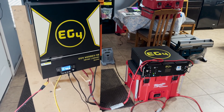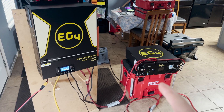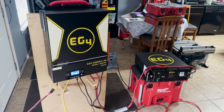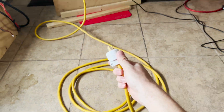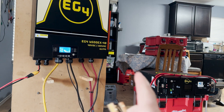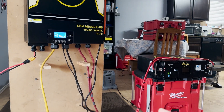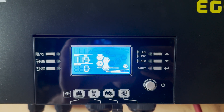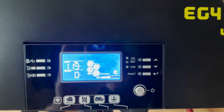Next I'm going to show you utility charging mode and the current going into the battery. This thing is capable of a 120-amp charge, which is a lot of power. I have it set down to about 8 or 10 amps because I don't need to charge that fast and I can't get that much amperage out of a standard wall outlet — that's like 5,000 watts. All you have to do is install the incoming AC cord. If you had the inverter turned on it would do bypass mode — all your loads switch to the AC going into the machine and it bypasses the inverter itself while charging the battery. You can charge with AC and solar at the same time. Looking at the display we have MPPT converting into charging and we also have line current — the wavy one — going through the charger and into the battery, so we're charging with two different methods at once.